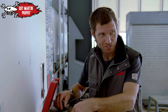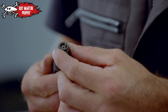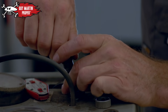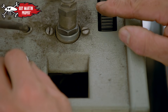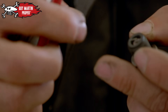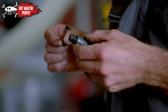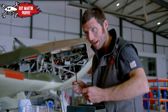After a bit of grit blasting, if the plug comes out brand new — that's good. After dry cleaning, each plug has its spark checked and gap adjusted. A little touch on the thread, then copper slip is applied before refitting — just a bit of lubricant so they tighten up nicely and come out a bit easier. It's like it's never been away.